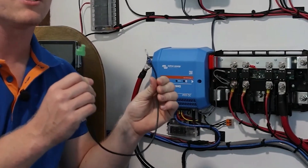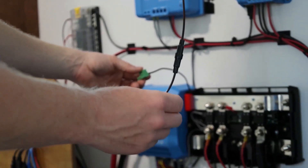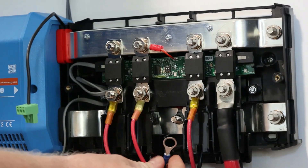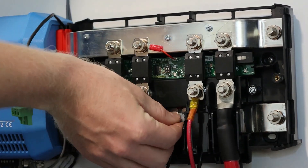Install the included ground wire first. Make sure to fuse the ground wire — today I'm using a 1 amp glass fuse. Land the ground wire either on the battery terminal or on the main battery bus bar.